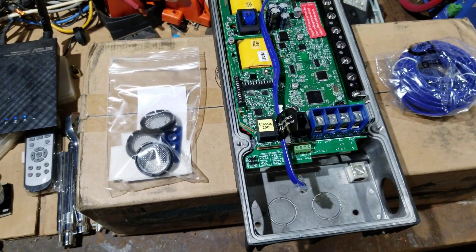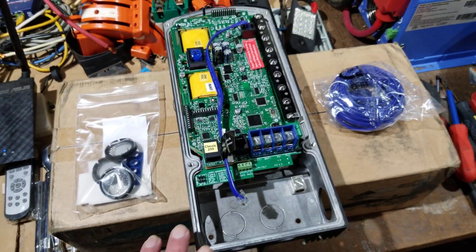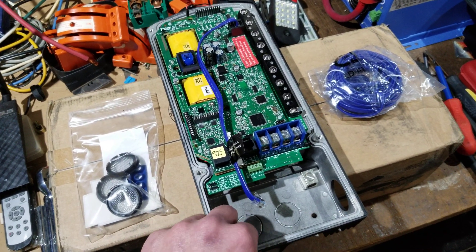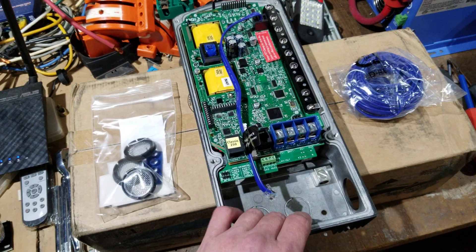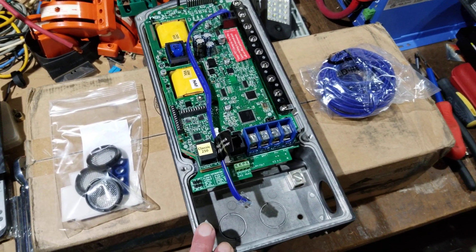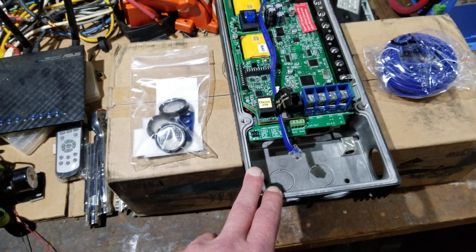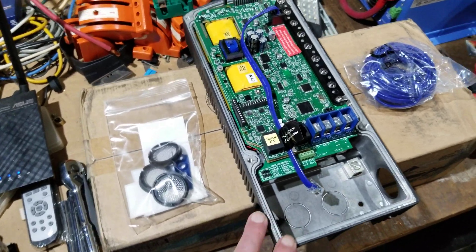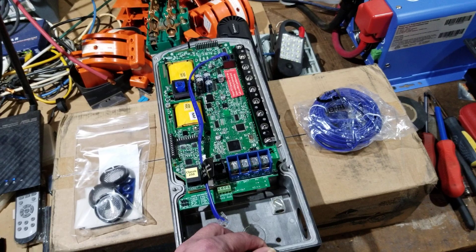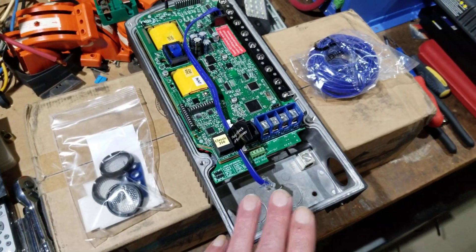It's 62 to 63 amps max. If my memory serves me right, you can get probably 750 watts worth of panels at 12 volts, 1,500 watts max at 24 volts, and probably around 2,800 watts at 48 volts. But for high-voltage applications and for the price, you can't beat them.